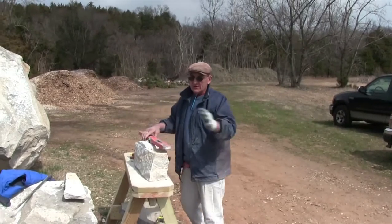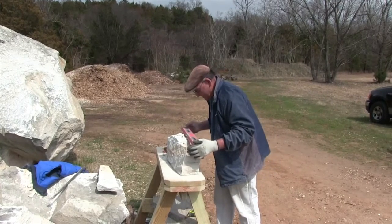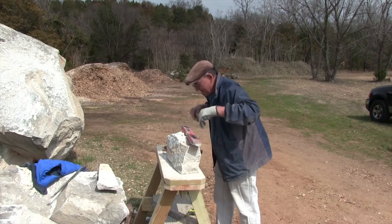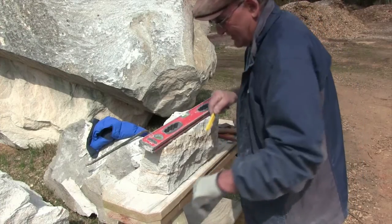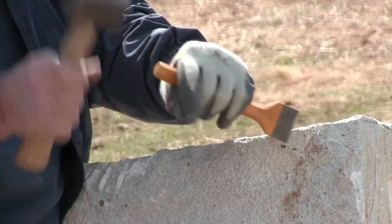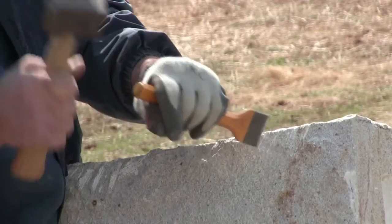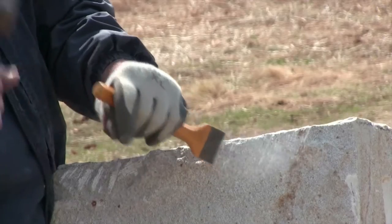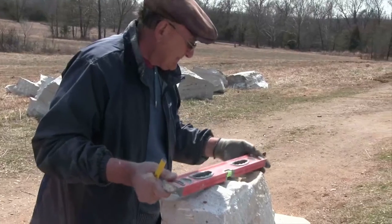What I'm trying to do is get the face of it in a plane. So what I'll do is I'll take a straight edge and I'll sight it and line up both ends of the line so my edge — the edge of my stone now — will be right along that pencil. So when we set them in the wall, there won't be any lips on any of the mortar joints, none of the mortar joints will be hung over, and we'll also be able to keep our mortar joints relatively compact.